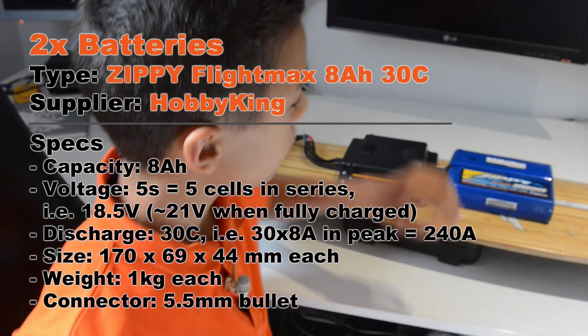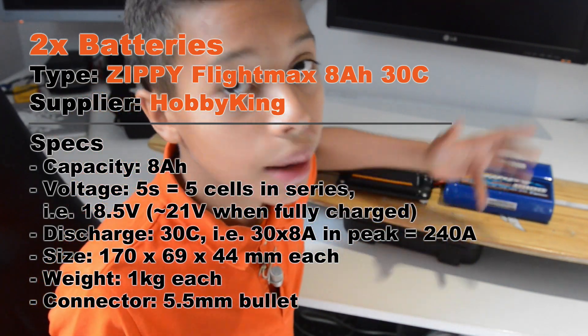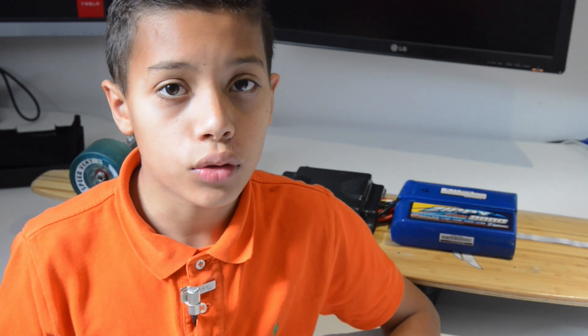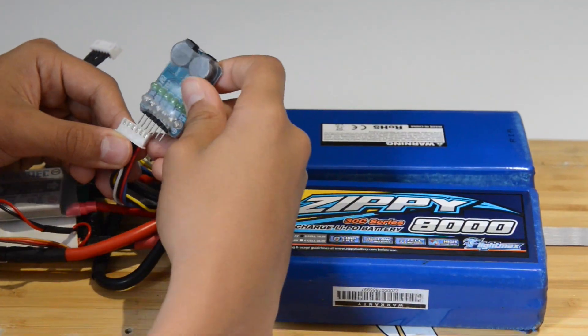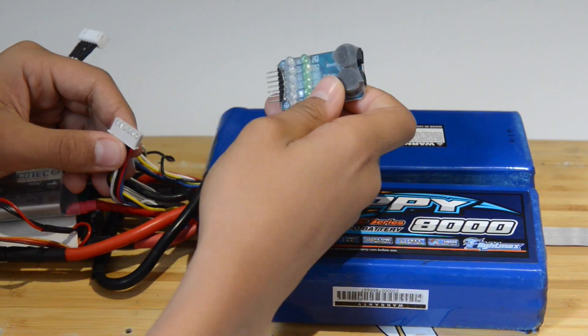Now let's talk about the batteries. Our motor is designed for a 10-cell battery pack, so we're using two 5S batteries wired in series. Be careful — LiPo batteries are fragile and powerful. If handled incorrectly they will catch fire, so read up on them as much as you can. One thing about LiPo batteries is that they hate dropping below 3.7 volts, because it reduces their lifespan significantly. The different cells do not discharge at the same time, so as soon as any of the 10 cells drops below the limit you want to stop and recharge as soon as possible. This means you have to monitor the voltage of each cell individually — this is where the battery monitor comes in. It connects to the balance port of the battery and makes a loud noise as soon as any cell is reaching its limit.